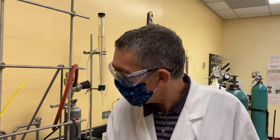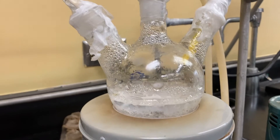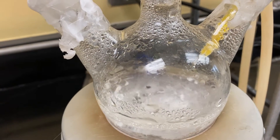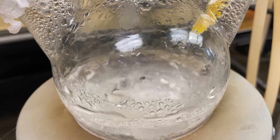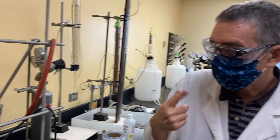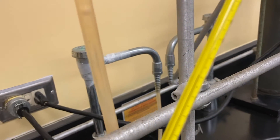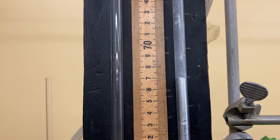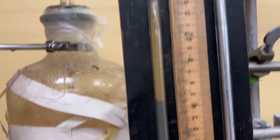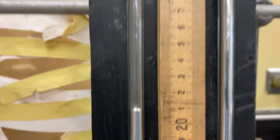Dennis and I have decided we're going to call this boiling. You decide what it looks like for you, but you need to use that same picture consistently. See the temperature — go to the manometer. So you've got the temperature and you're getting the pressure at the very same time. You can't take the pressure in advance because it's going to change. You record the pressure at the same time you record the temperature.